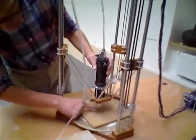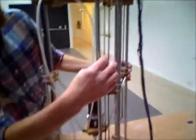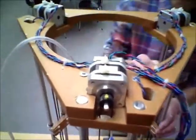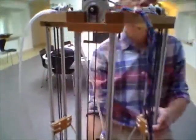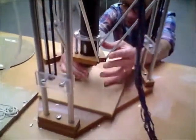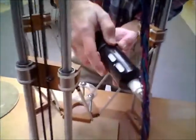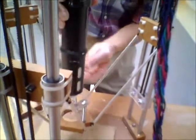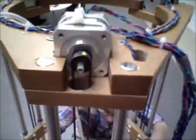At the moment you can see this is actually touching our base — we print onto a wooden base, but you can always check the level. We have made some little yellow marks on these, and if you get all the yellow marks to the top, that should represent what we call zero zero zero. Those are all there, and my height is still actually slightly high. So to lower the nozzle down that little bit, it's this rubber ring that needs to be just moved up a bit, and then that will lower down. With the little yellow marks on the top you should be just about a millimetre off the board.